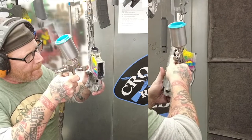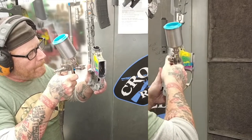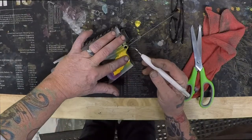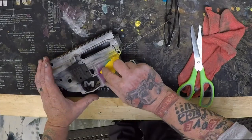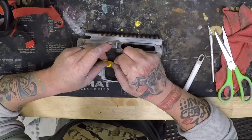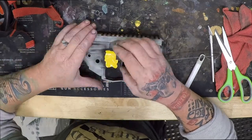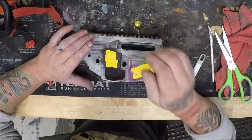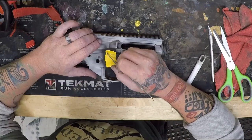We're out of the oven, masked off, back in the booth, spraying another little color. This one is green — it's in the middle of that 350, it's the 5. Here we are with another mask cut on the vinyl cutter that covers that entire 350; it's easier to lay down and keep down than individual pieces. Here is the masking on that SH. I do have a little leeway on these masking stickers because there is a color fill that goes around the outside of all those letters, so I don't have to be 100% accurate.